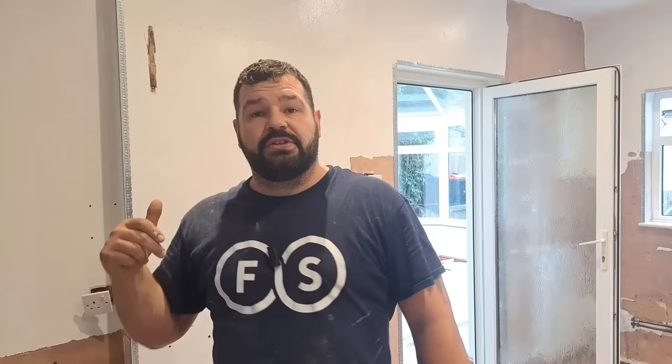Kieran's going to mix some plaster and we want to basically start skimming by two o'clock at the latest. Usually a mix of plaster takes about three hours, three and a half hours depending. We might be using a bit of accelerator on the second coat, but we'll see how fast the first coat pulls in and make a decision on that as we're skimming. Mix-up, let's get going.